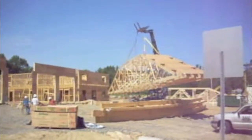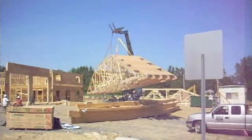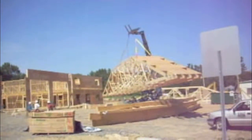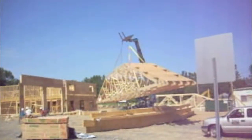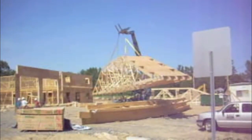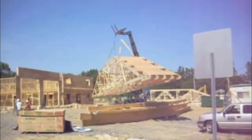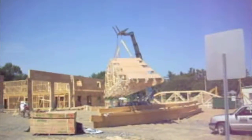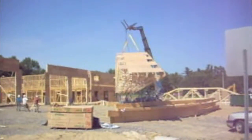In this case, what we did was we had the first four to five trusses installed with roof sheathing on the ground. Working with the contractor with the type of lift that they had and the slings, we analyzed picking up the truss at the locations shown in the video and the forces in the truss, and designed the sheathing and bracing such that it could handle the lifting loads and be installed in a manner that's safe for the building, the occupants, and the contractors working underneath the trusses during the installation.